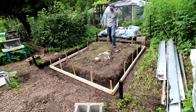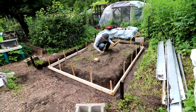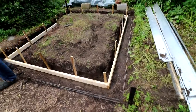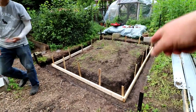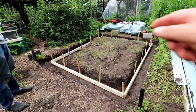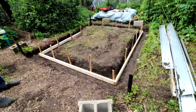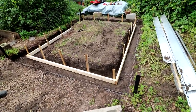So I'm going to have a whole day of concrete work. I'll have to get my rebar in place, set at the right height, about halfway up on the 2x4s there. And then I'll start early in the morning mixing concrete. There's a big tub I'm mixing it in the middle. And then I'll just shovel it around, keep mixing and shoveling all day. And then I'll level it off to the top of the 2x4s. And that's where my concrete block wall will sit on top of that.